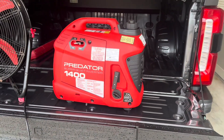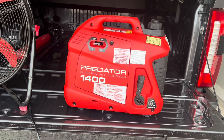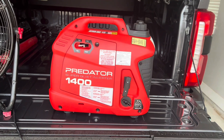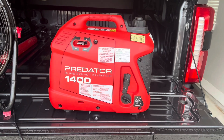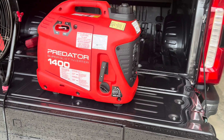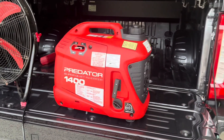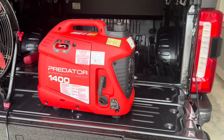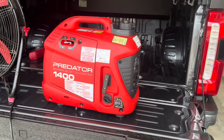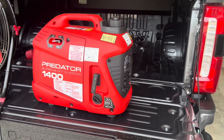The 2,000-watt generators are nice too, and they're quiet, but they're getting more into that 50 to 60 pound range. I want something I can just grab, carry it outside, pull it one time, start it right up — easy. You don't really need a big generator for a fan. I could probably run three fans that size with this generator, no problem. Being an inverter, it's only loaded at probably 20 to 30% with one fan, so it idles down. It's just a nice gen set, and I've been pleasantly surprised with it.